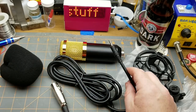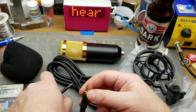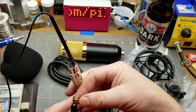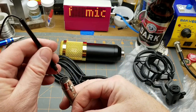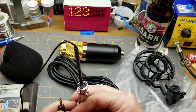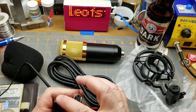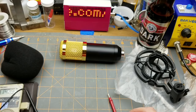I want to check this cable before using it — though I wasn't really planning to use it anyway. Normally I'd expect that to be the ground, and it is — pin 1. Pin 2 is both the ring and the tip with no difference in resistance. Pin 3 is on the sleeve. So they've got one side of the audio pair grounded and pin 2 as unbalanced audio to both tip and ring — probably not going to use it. That means I need to get myself another cable.